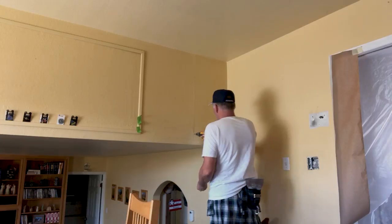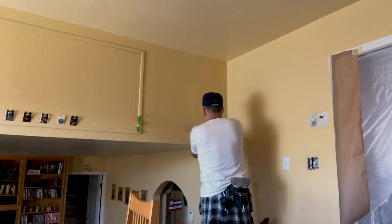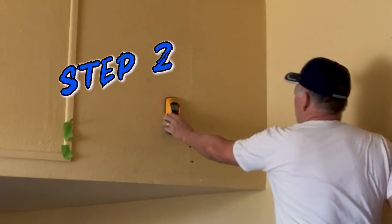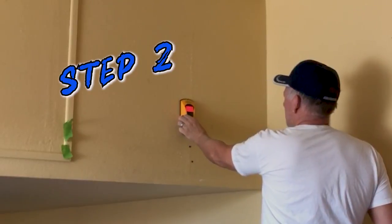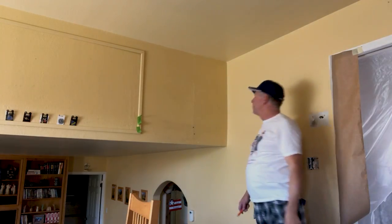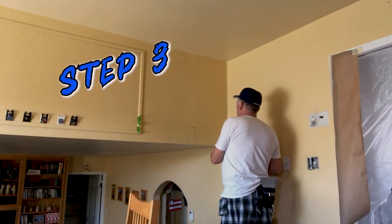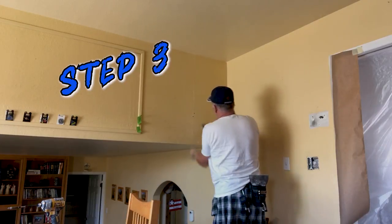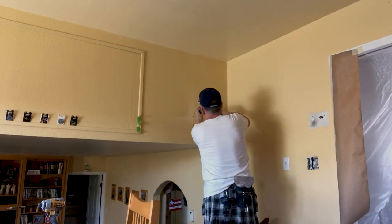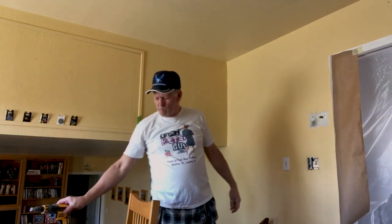Now we're ready to put some screws in, and I'm using an actual drywall screw gun — this one is cordless. You'll see here that my first few screws missed, and with a drywall screw gun you can tell pretty easy; they make a sinking, ratcheting sort of sound. So I broke out the stud finder to figure out what's going on, and it basically told me it's there. I was probably just missing it by a little bit. I went ahead and kept trying, and sure enough I found solid wood. Just keep going until you get some screws in it, make it solid, and tighten everything back down. This will help keep it from cracking again in the future.